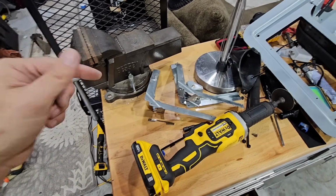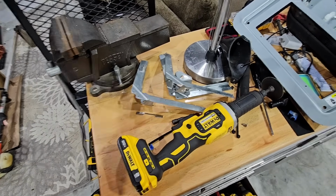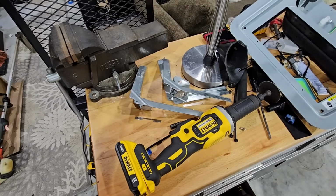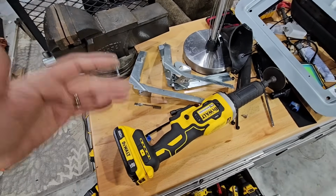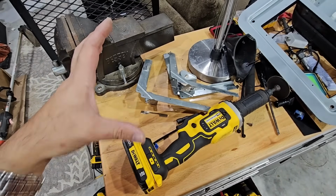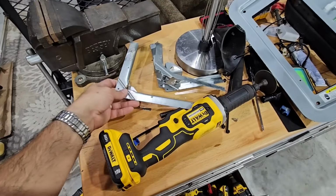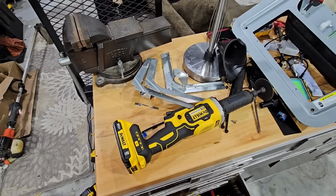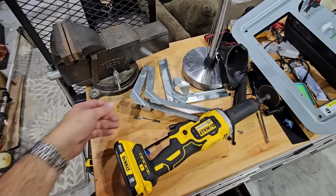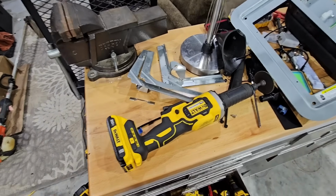I always run into this complication with AC replacements where the bolts just aren't long enough. Why do I have to be working on the RV that for some reason has an infinitely too thick sealing roof membrane for me to get through all of it and tighten it down? Anyways, I'm going to continue to grind down on these so I can have the corner brackets that hopefully will work. But you know, if I ever get rid of that other AC after fixing it, somebody's going to need a new frame because I'm using this one.